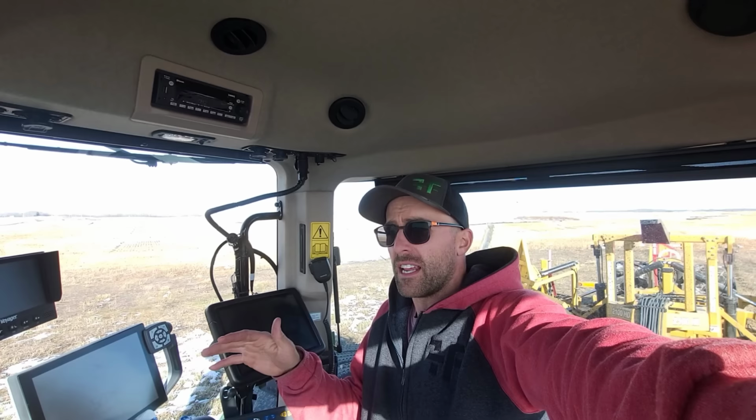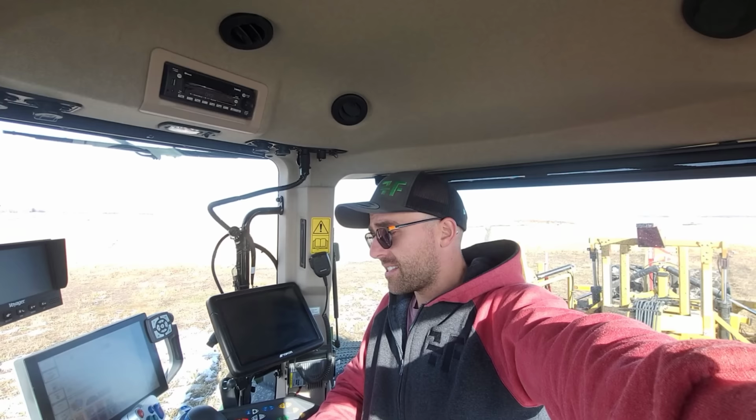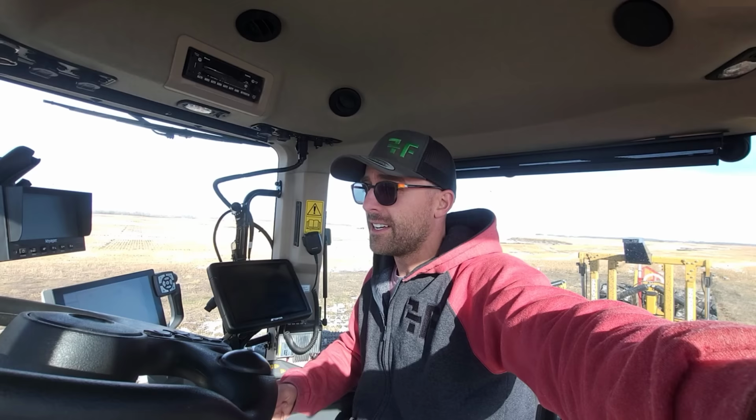Oh yeah, pet peeve. From the little bit of playing that I've done, since it's kind of snowy and muddy and melting and slushy, friction drive is not your friend. When you're pulling this thing and you need to get some traction to the ground, and you start turning it a little bit, you're like, whoa, and you're just slipping your drive wheel inside your track. Not a fan of friction drive.